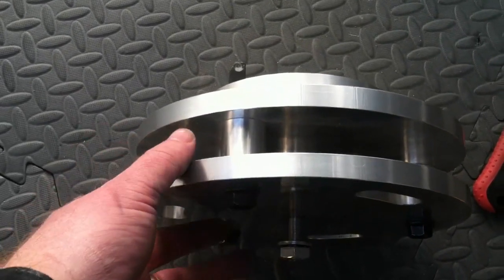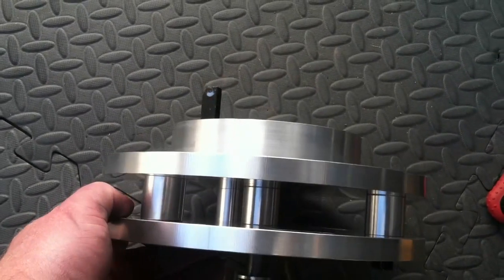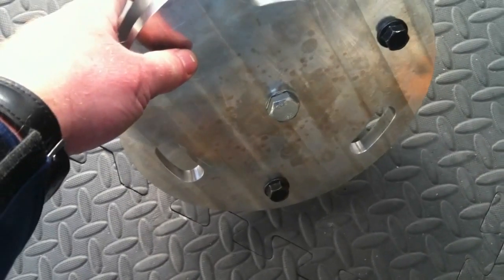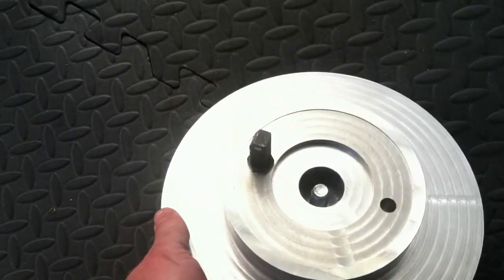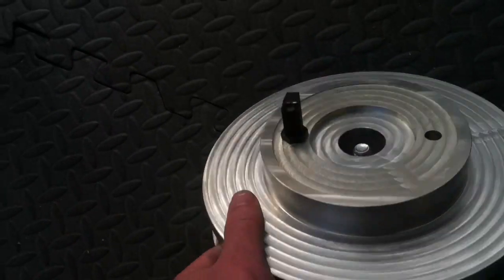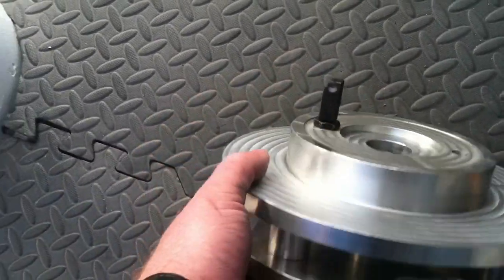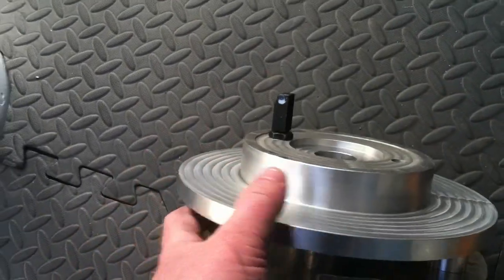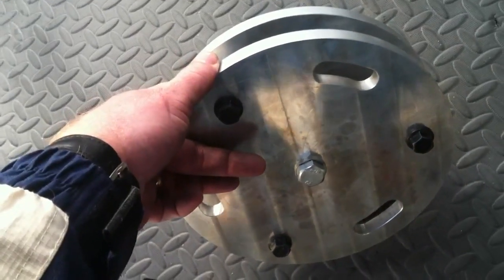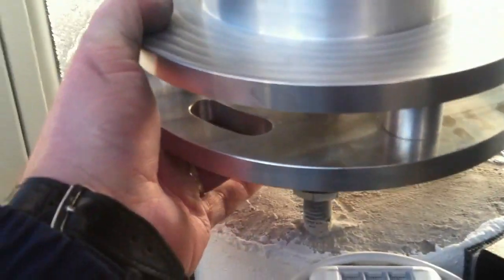Alright, I'm back. So I've got this all put together. You can see we've got our top plate and our bottom plate mated together. We've got our one-inch spacers in between. And we've got this captive 12-millimeter bolt running through here, and that's what's actually going to screw the mount on. And that little square black thing there is for the azimuth adjustment post for the mount — that's just left to right once the mount is up here. So basically this has got some slots in it, and those are going to slide onto the bolts up here.